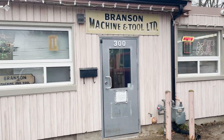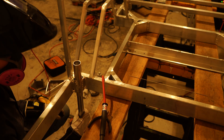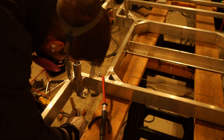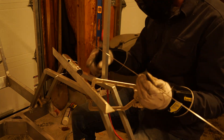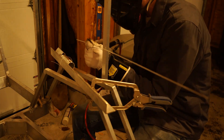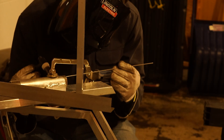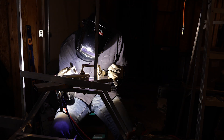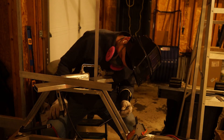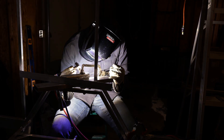Branson Machine and Tool. I had the guys take some material off some stock aluminum tubing so they would fit within each other nice and smoothly, and then I decided to weld on some brackets. These are just three-quarter inch angle and I'm welding them on with amperage lowered to about 100 amps on the welder, really trying to avoid any penetration into the interior of the tube which would interrupt the telescoping. So yeah, that worked — 100 amps, just gotta take it slow.